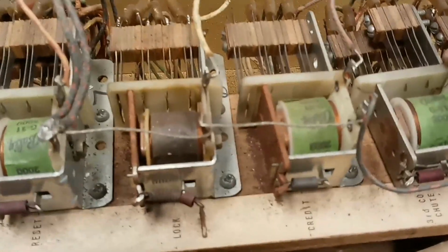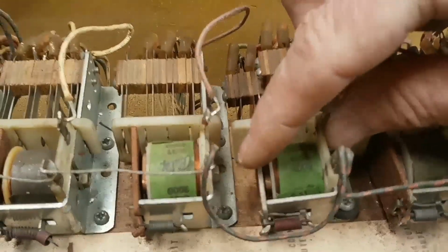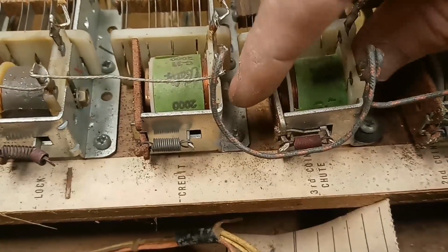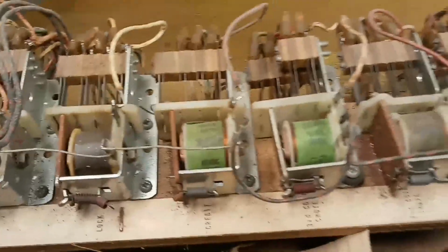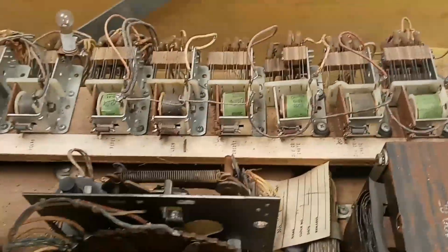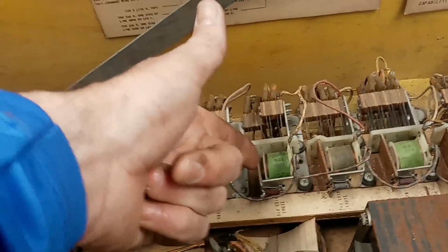A couple other things I saw. It's always good to just walk through these things and look at them because, oh, this one here. This coil has grommets supporting it, but it's leaning down to where this plastic part is actually touching the wood beneath it. So that's never going to really work right until those screws are tightened up so it's sitting up again. That'll have to be addressed. These are the kind of things where, if you start to play a game and it's not working, you have to diagnose why, and it'd be a weird intermittent problem. Sometimes it might work, but not right. It'd be very hard to track down. But just using your eyeballs, fix it on the front end.